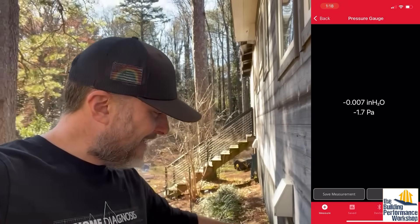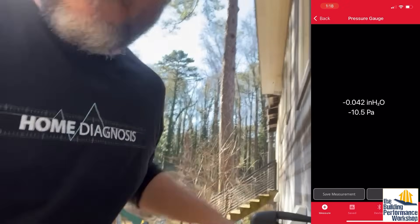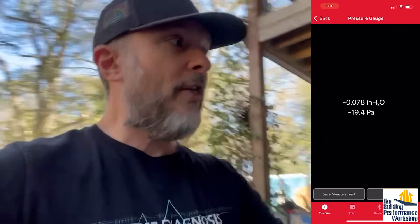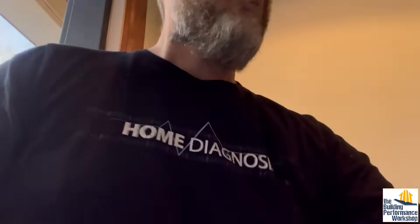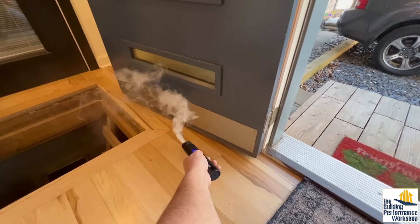When I depressurize the house on low speed, you can hear we're depressurizing it pretty massively, so I'm going to relieve the pressure by allowing the house to breathe. My house's blower door test is 300 CFM, so I allow the air to come in through the front door and go down into the crawl space — now I've got this wind tunnel. I can feel air coming through the door, and that's how we're going to stay so the house can get the air it needs while also getting this stated 1,500 CFM from the fan.